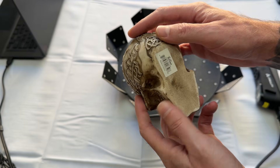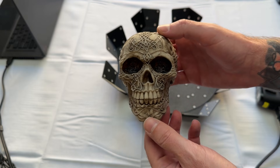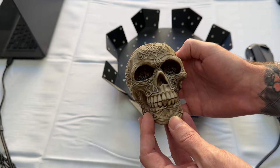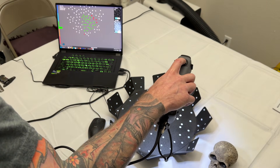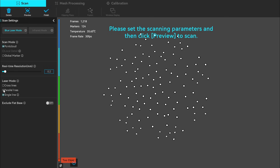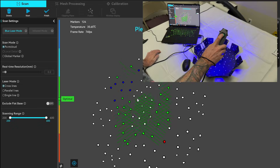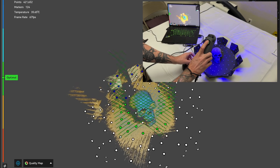Once calibration was complete, it was time for my first scan. I wanted to try the skull I have — it has plenty of detail and with the eyes and nose sunken in it seemed like a good starting point to test all the blue laser light modes. To start, I scanned the global markers first. This isn't necessary but it helps speed up the process. Once done, I switched to point cloud, set the resolution to 0.2 millimeters, and set the laser mode to cross lines, using the 34 blue laser lines.